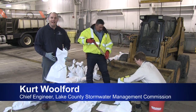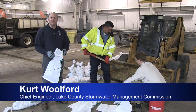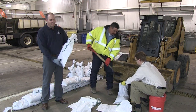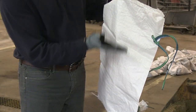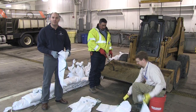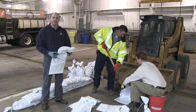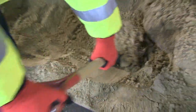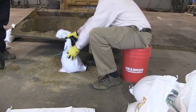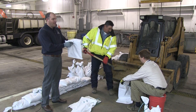We're going to go over how to fill a sandbag properly and how to stack them for flood fighting techniques. Sandbags generally come in a polyethylene shape and have ties on top. Any material can be used to fill a sandbag — dirt, clay — but sand is generally the easiest to work with. When full to the top, it can weigh up to 70 pounds and doesn't compact right in the wall, so you only want to fill the sandbag halfway to two-thirds.